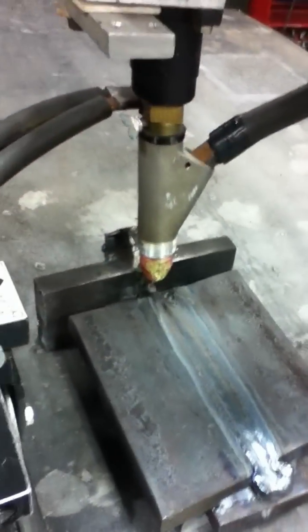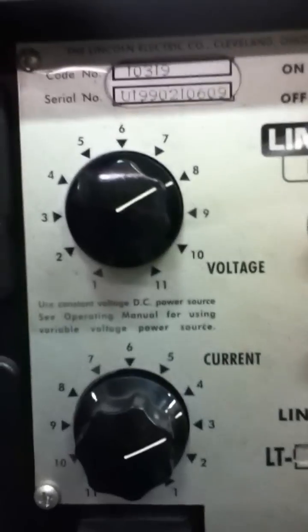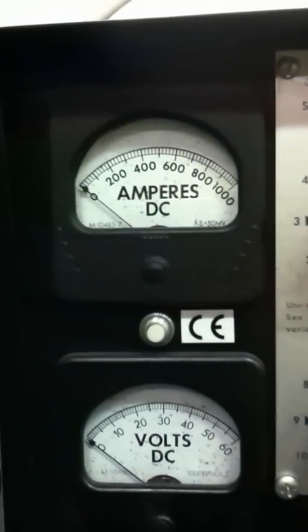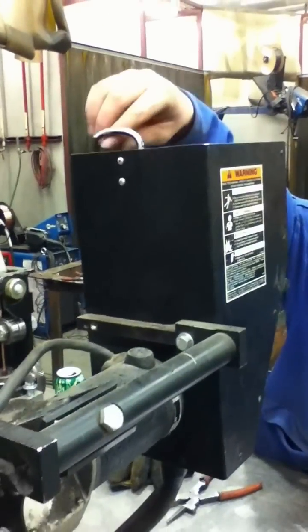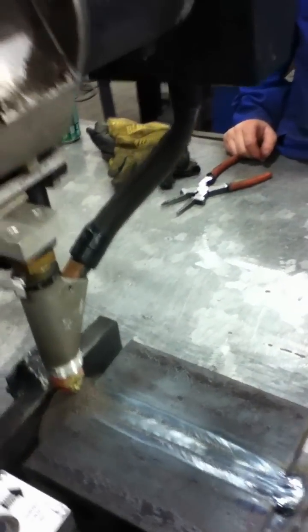Let's come over here and look at our settings. We're at about 10 on our wire feed speed, about 3.7 to 3.8 on the current, and voltage is at 8. We'll come back and look at the actual amperage and voltage while we're running. Right now we're going to turn the flux on, let that build up for just a second, and now we're ready to go — we're going to press start.